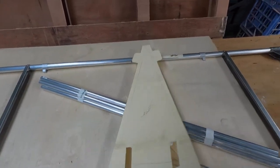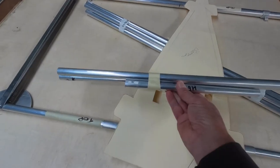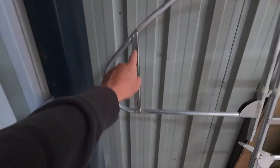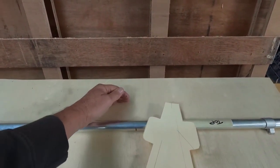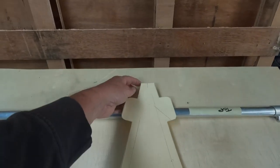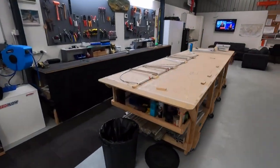So that's the bottom of the fuselage that I traced. Then that'll determine where these cross members go to pick up the four mounting tabs. And then there's a horizontal part that goes across. That needs to pick up my particular mounting point for this bolt here on the rudder. So there's a lot of what ifs. Also the distance at the trailing edge with a hinge and a spar, then the rudder post, but the elevator needs to move, so you need a position. I know this template is against my rudder post, so once the elevator is finished, that'll determine another position.